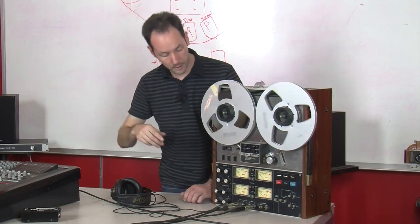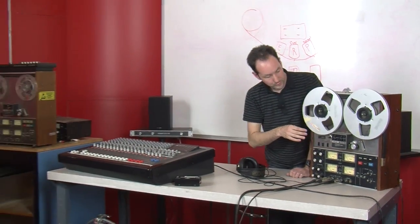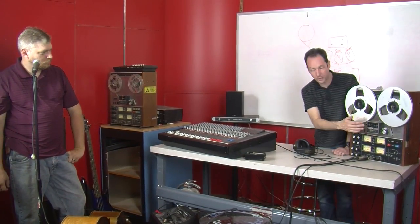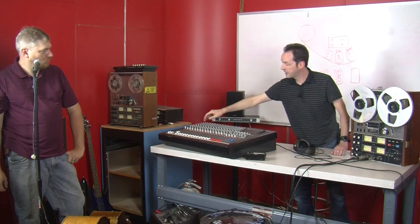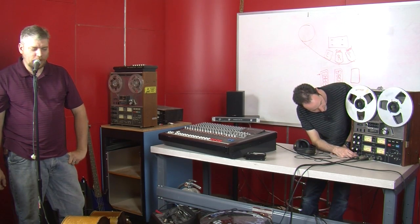So you're going to talk in that mic, and I'm going to set us on low speed. So it's taking the tape, it's 15 inches per second, and we've got probably 1 inch, so we've got 1/15 of a second. Excellent. So as you talk into there, I'm going to bring the level up here so that we can hear it. Check 1, 2, and you just talk. 3, 4, 5, 6, oh, 7.